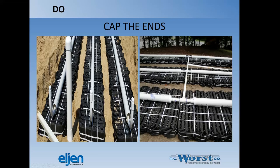Do cap the ends. You can see these ends are capped. These are not here, so you want to make sure the ends are capped, especially on a pressurized system. On a gravity system, you're going to cap the distal end or lateral end. On a pressurized system, you're going to cap both ends and you're going to drill a hole in the front end to accommodate the entrance of the pipe.